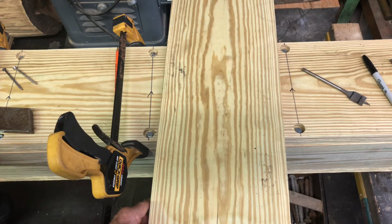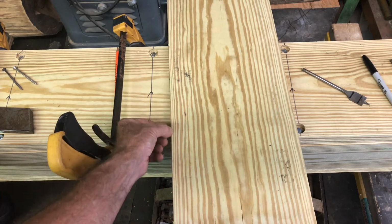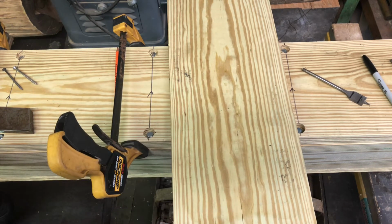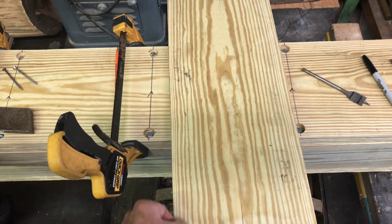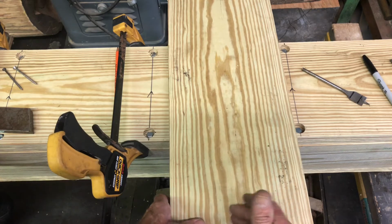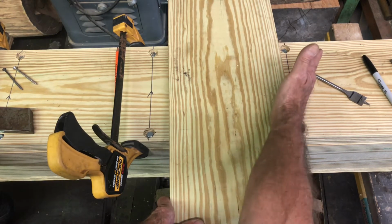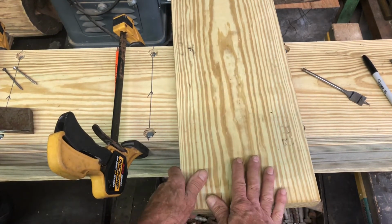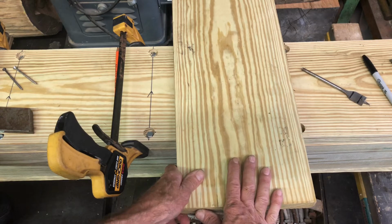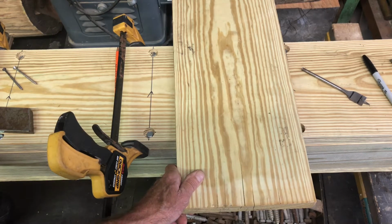And that means that when I say runout in the grain, I can see this grain runs along and is approximately parallel to the length of that piece of material. But in pieces of material that were not properly milled, you can potentially see a lot of runout. And although it's not a problem with some materials, other materials are highly sensitive to runout, like redwood.